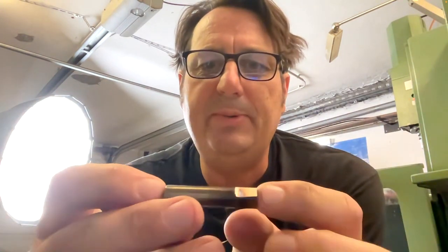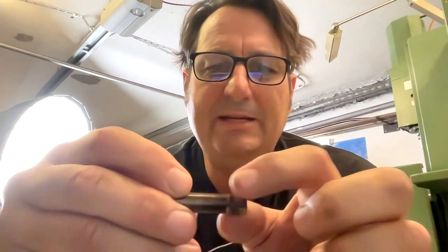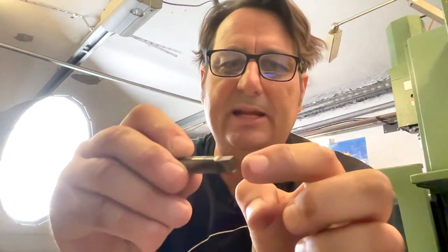Let's just go to the comment section. Rustinox. Oh, hey, Rustin. Hey, Michael. Great to see you there. He could have started with a piece of round high-speed steel. Yeah, I did go through my old scrap 10mm end mills, but this tool needs to be about 45mm long because it has to stick out of the rotary broach exactly 20mm for the center to be in the right center of gyration. And what I found was none of my high-speed steel broken end mills was long enough. So that's why I went with this. Plus, everyone on YouTube loves to see fire.